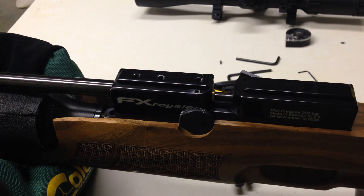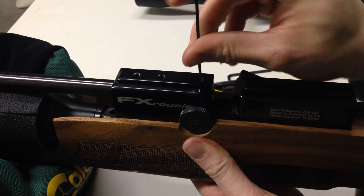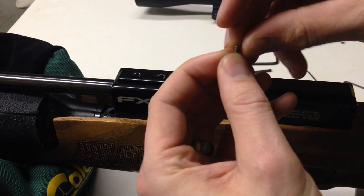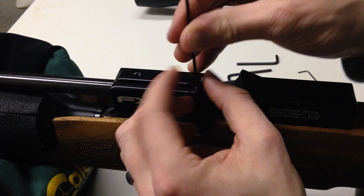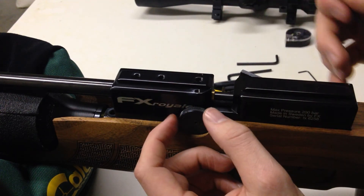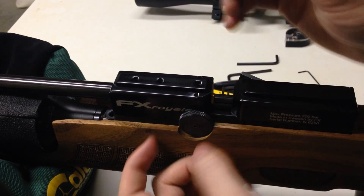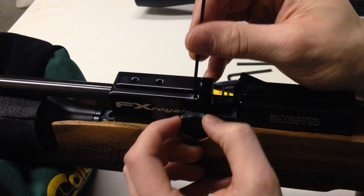Take your locking screw, which I left in there turned out, and just turn this back in. Get that snug. Then drop your ball bearing back in this left-hand hole, drop your spring, and then the screw. When you tighten this screw back down, you don't want to over-tighten it or under-tighten it. Screw it in until you start feeling tension — now you're pressing the screw against the spring. When it locks into each position nicely and the ball is falling into the detent, you're pretty much set. If you want it easier to turn, you can back it out a little, but then it doesn't lock into the positions quite as nicely.